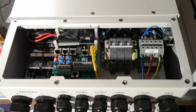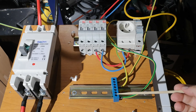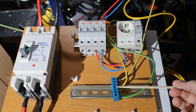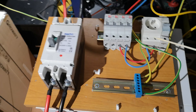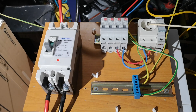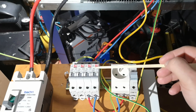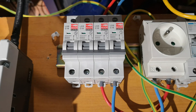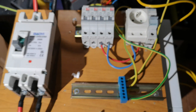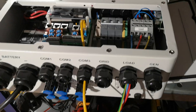One last look here. I connect all protective earth to this bus bar — also called an e-bar or e-bus, depending on where you live. I wanted to have protective earth also on my socket. So basically we take neutral and phase going into these two AC breakers, which are rated to 16 amps. So we won't be able to test maximum power, but from one phase you should be able to get four kilowatts easily.